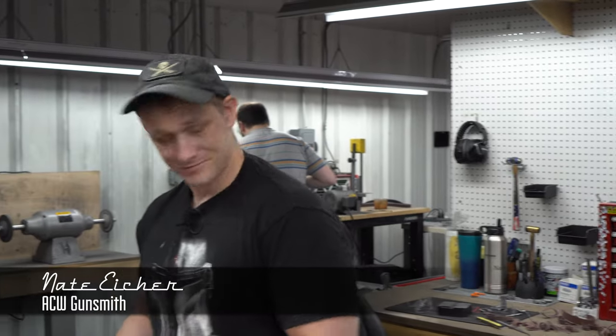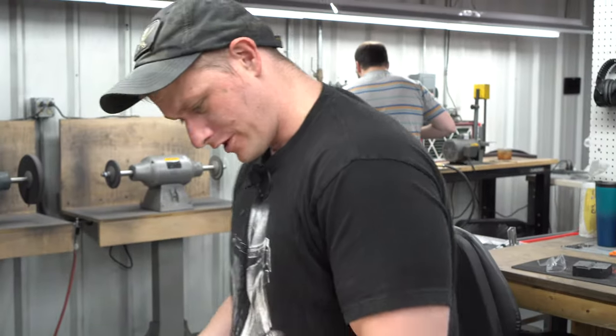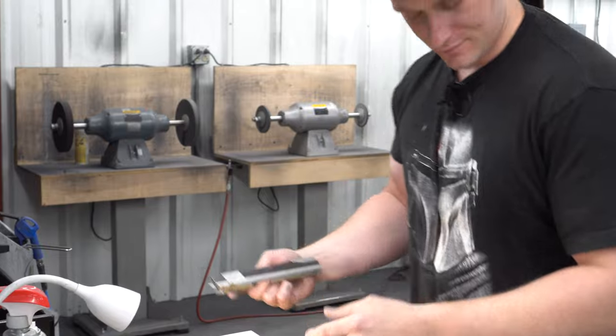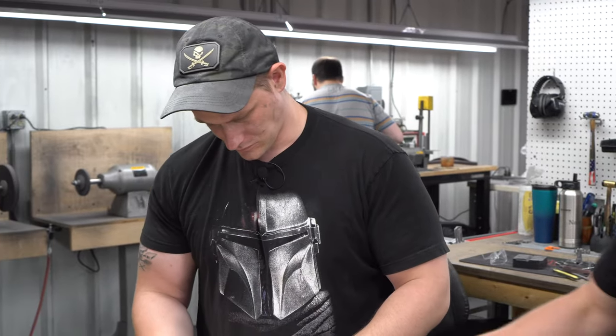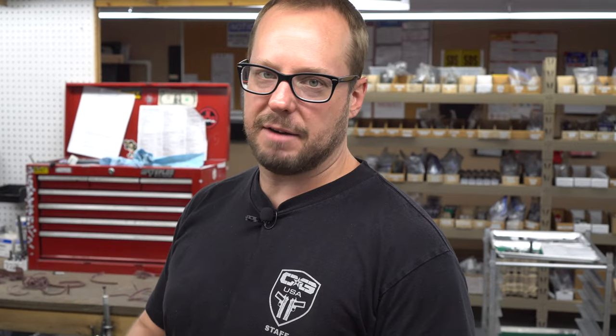How's it going, Nate? I'm working 400 grit on the flat of this slide here, just trying to get my lines even, trying to get the side nice and shiny so when it gets to someone it looks good and makes them happy. This is pretty late in the process — Nate would have already gone through and removed all the tool marks from the rounds. This is after fitting, after test firing — we'll clean them up, get all the hand beveling done, and then actually start taking all the tool marks out. That way we know it's in a condition ready for final prep.